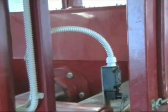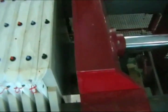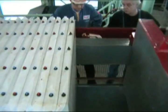An optional vacuum pump can suck out the small amount of remaining water, leaving a dry, light and easily handled cake. When the filter is open for cleaning, almost all the cake simply falls to the bottom where there will be a skip or a conveyor belt waiting to take it away.